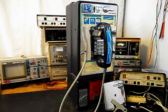We're going to have to redesign some circuitry. We're going to have to build up a little bit of extra circuitry. So there is going to be quite a bit of work involved in trying to save the electronic volume control for this payphone. Now, the programmable boards that are in this unit will have to be removed. They're of no use to us, and they cannot be used in the conversion, so they will be removed. We will also need to redesign the bell circuit, and we want to add a switch to turn the bell on and off into that circuitry for the bell.